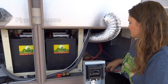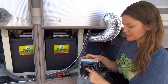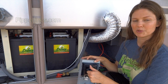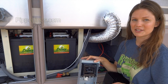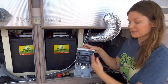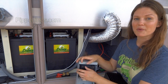These are my lines coming down from the roof — coming down from my solar panels. They're going to go in here into one fuse, and then from there go to my charge controller. That will be the input of the solar. That fuse, because it's so close to the charge controller and farther away from the solar panels, it's not really protecting the line, but it's something that can be removed to disconnect — which means you're kind of turning off the solar panels, not from harvesting, but you can use that to shut them off for maintenance. The output from the charge controller to the batteries will run through the second fuse, which is really important in protecting the line, and it also has that switch modality so you can disconnect it for any maintenance on the line.